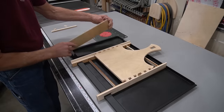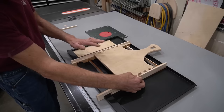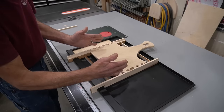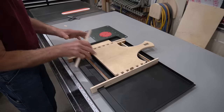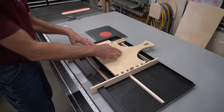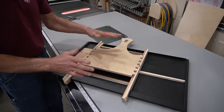And I deduced that a scrap exactly 3 5/8 inches wide dropped in here with this particular fixture holds this in position when I slide it up next to it, and that holds the center mark of the tool tote end at exactly X equals 10 inches. And because I don't want this thing wiggling around, I just made a stick over here that holds all that in place.